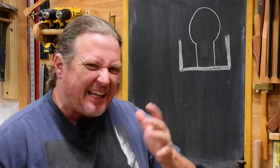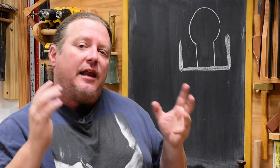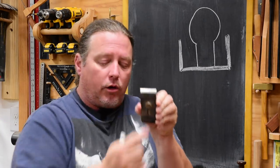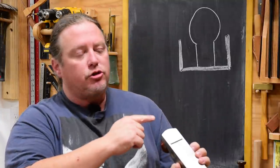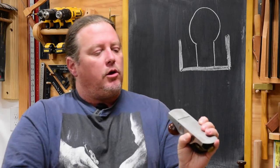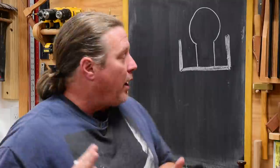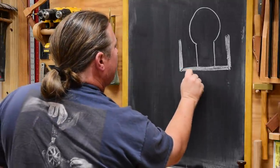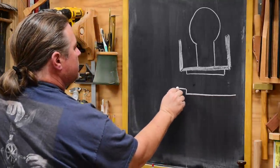Now let me clarify a few things that got glossed over. Normally when we sharpen our blades, we are taught to keep our fingers balanced, whether using jigs or freehand, and it ends up with a completely squared blade. When setting up a blade that is square, you look down and judge protrusion based on the shadow you see — two sharp edges don't reflect right off the edge. So when you're planing with a square blade, you get these ridges coming across.